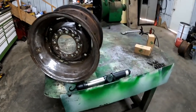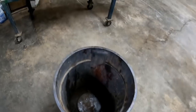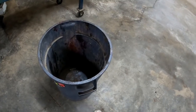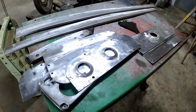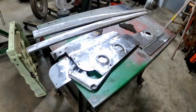There are lots of videos on electrolysis rust removal on the internet, so if you Google or search YouTube you'll find a lot more, but I've been using this for a while. All the sheet metal here was cleaned with it, with a little bit of wire wheeling afterwards. It doesn't do the best with getting paint off, but it does great with rust — the rustier it is, the better it does.